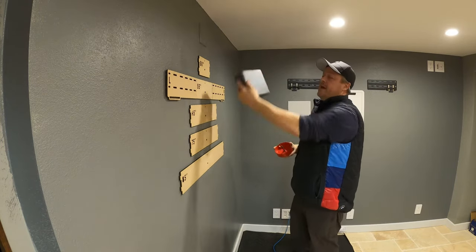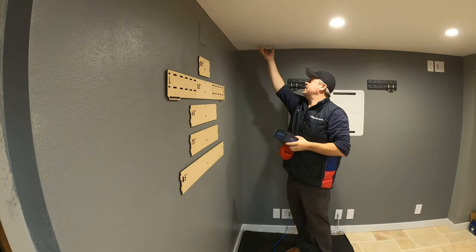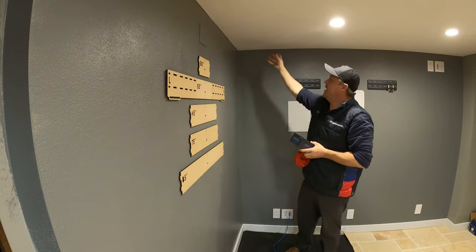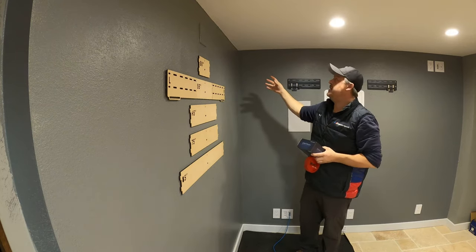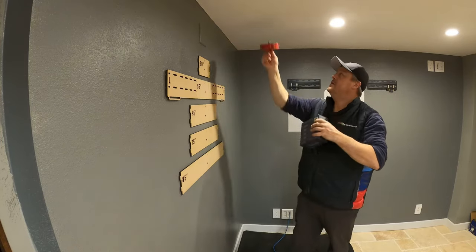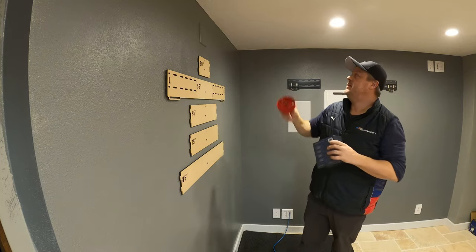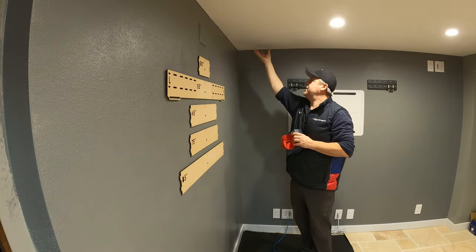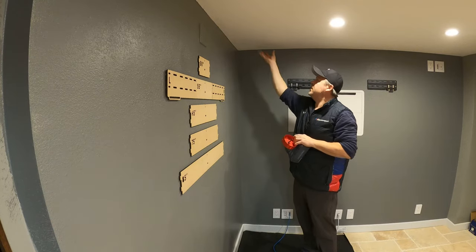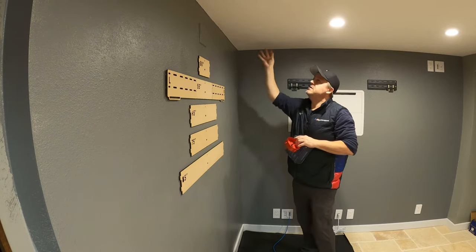We'll mount a Brio Spectrum can in there. The next option I'm going to show you is more advanced — we use a template that we double-back tape to the ceiling and then use a hole saw to pop it in. We do that on more fragile finishes like a cedar ceiling. I also want to show you how it works in case you're concerned about cracking drywall. Using the second method with a template, you don't risk messing the ceiling up at all. I'll show a couple of images in the video of how we've done this.